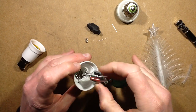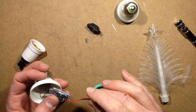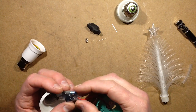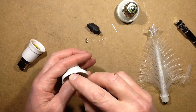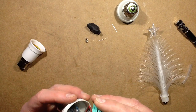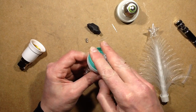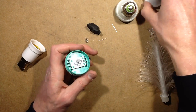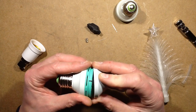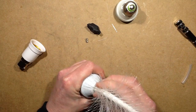The heat shrink has been applied, it's been reconnected in here, so I just need to stuff this back in. Now I'm not so sure about the zener — if the LEDs did go open circuit, it could get quite hot depending on the voltage rating. But then again, it stands fairly proud on the circuit board so it's not that bad. So I'm just going to stuff that in, and this aligns with little indentations so I'll get that right. I'll put this cover on as well — it has little bits that slot into the housing to keep it square. Then the fibres go in and I'll screw into this adapter.